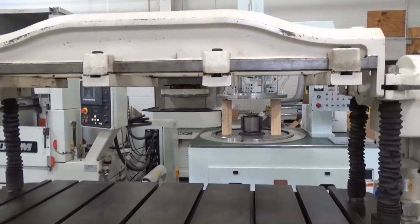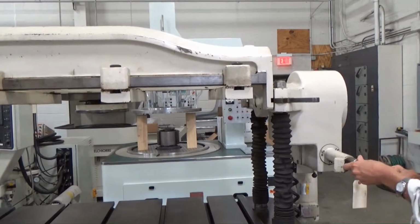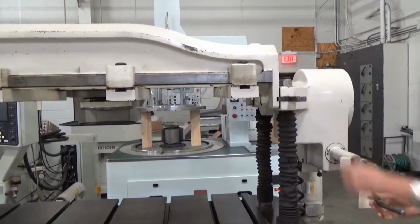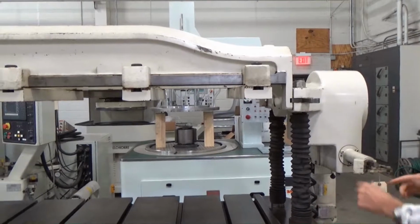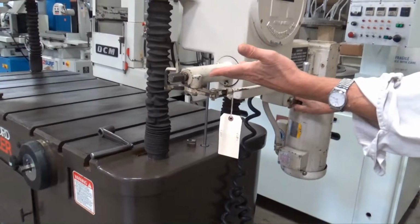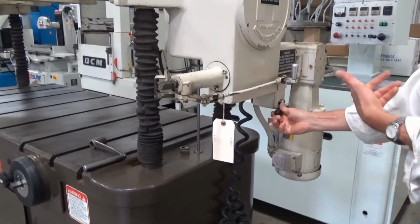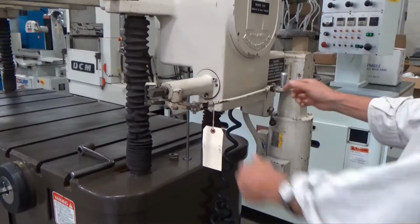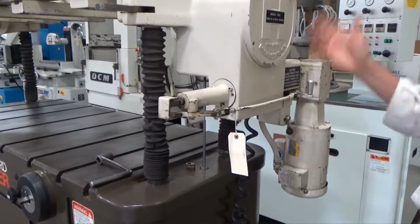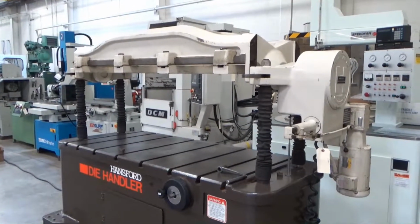And to get that lined up, I would just hit the crank button. See, we're not in right now. And crank that back to the front and down a little bit, maybe right there. There they go. So those four would go back in. And now, right now, if I hit this, it should not go. See, nothing goes. It just spins its wheels. There's no clutch engagement. So it still works, but we're not tilting. You have to bring this back in. So yeah, that's pretty much it. Get that to line up, there we go, and then it'll take off. But we're locked in right now, and did I mention it's 480 volts, and it's a good running machine.